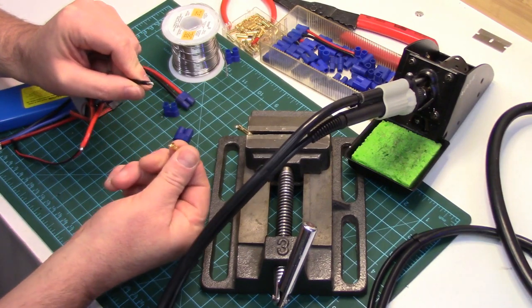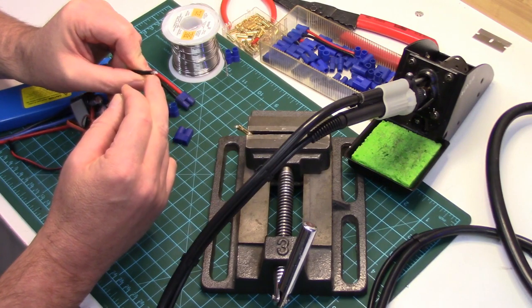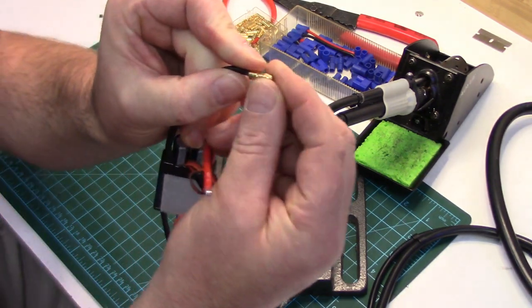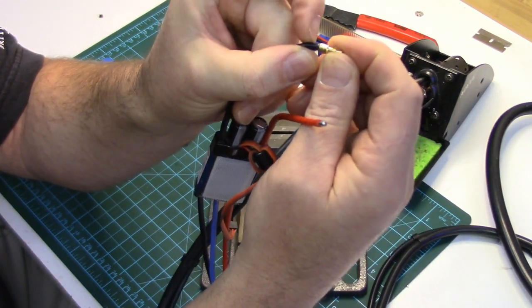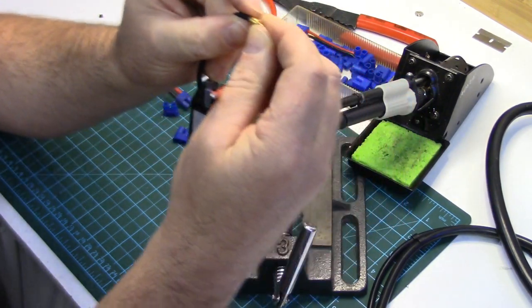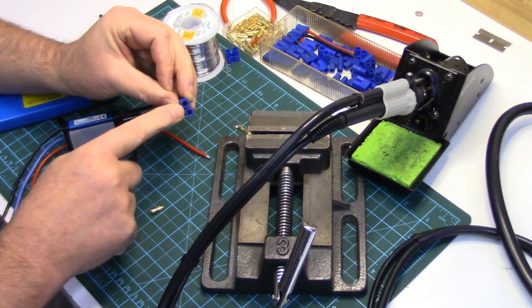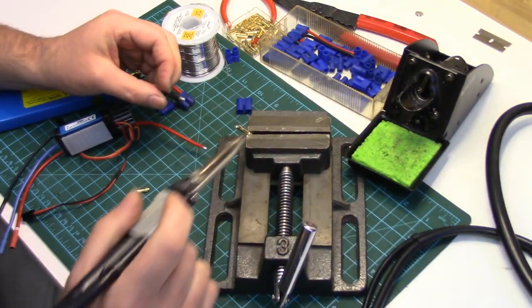As far as the distance you want stripped and tinned: you basically want the tinned end to completely bottom out and disappear into the pin. Just long enough so it bottoms out in the pin and the insulation comes pretty much to the end of the pin. If the insulation was back any further, you'd have exposed wiring out the end of your connector — so short potential.